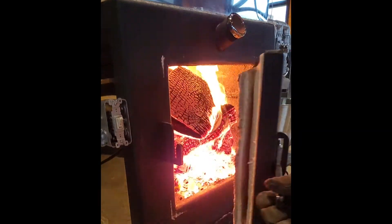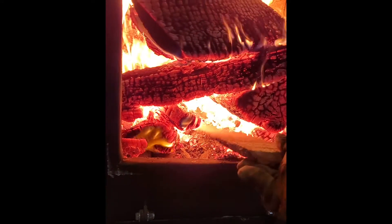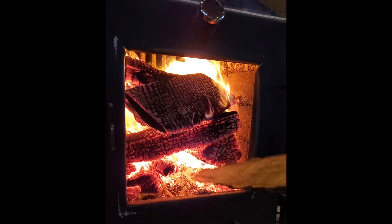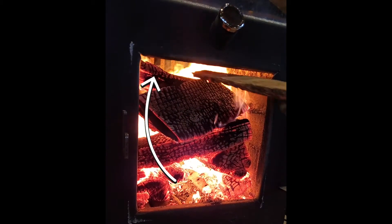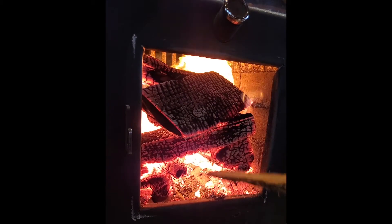So I'm going to pop this door open and show you what's going on. See all of the open grates here? You see the space right here? The fire is cavitating. All of this combustion air is too far away from the wood and it's circling up. Look at how hot that is in there. It's circling up and over the top of our wood pile and out. It's not going through the pile of wood like we need it to.